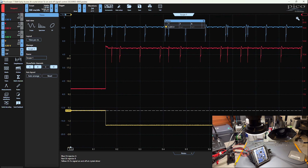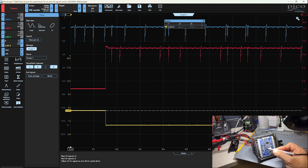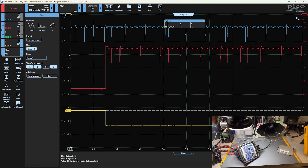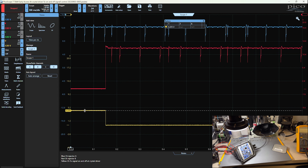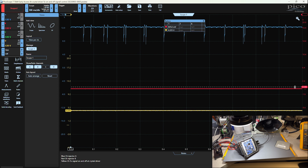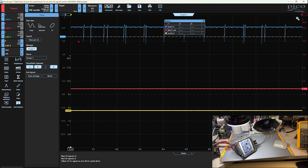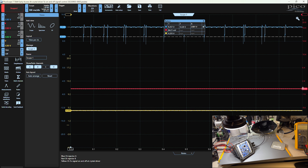Using one of my attenuated leads I went over to the actual control side of those crystals, poking in carefully not to damage the board. We can see the result: the yellow channel is my pin lead checking in there. Going back through the recording, the driver on injector B is completely grounded through the entire time. On the blue channel it goes on and off but not really pulling all the way to ground — it's going from 12 point something down to only about 9 volts, which is not enough to pull the injector down.